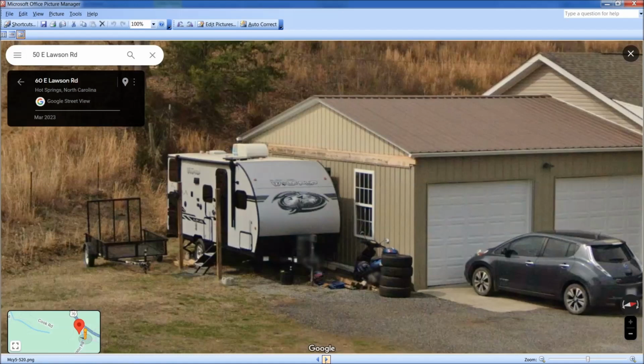This is why it might be entertained that this is sided over at the same time, to just bring both of these structures together. Right now they were departing because this was vertical and that was horizontal siding. So just eliminate this if that's not going to be used. My feeling is it would be very inexpensive to just extend this roof over, because really that's just two more of these trusses to get another 9 feet width here, and whatever end wall type of situation they might design. This is just from the same metal building manufacturer, but that just came up during the filming.